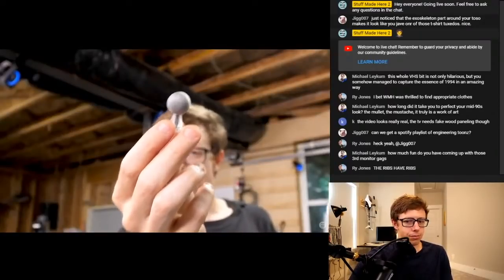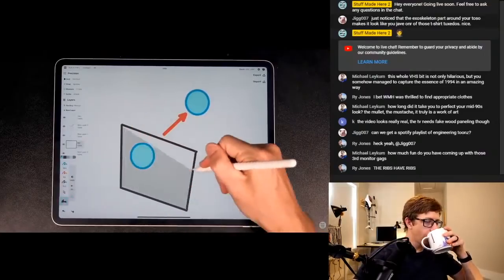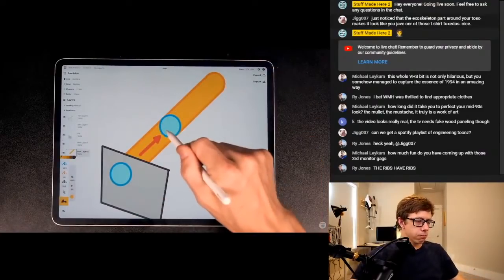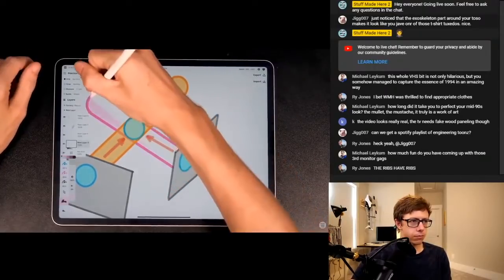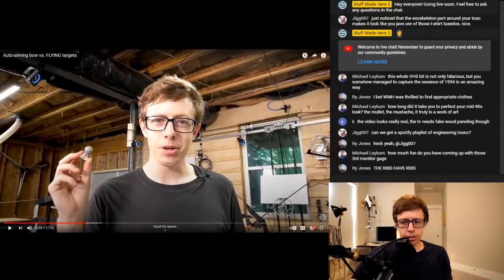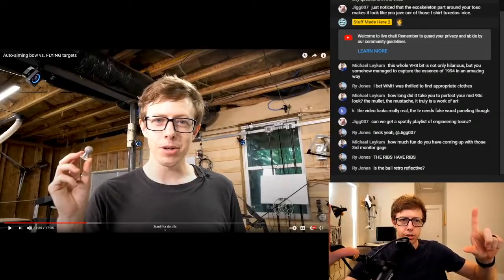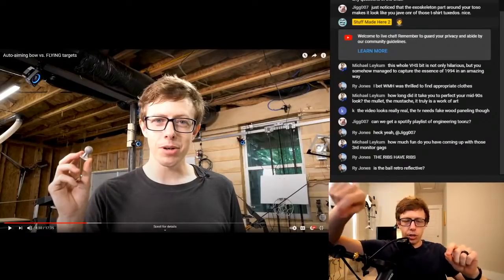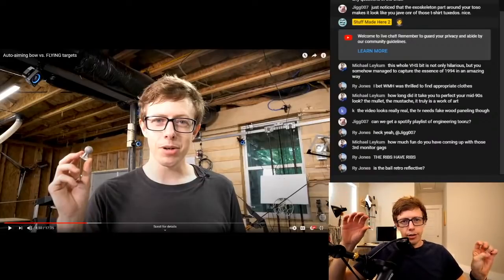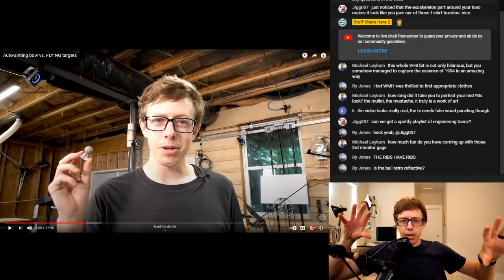Here's how it works. If I hold up this little reflective ball, it's seen by all the cameras at the same time. The camera takes a picture and if you project an imaginary tube out from the ball in the image, we know the ball must be in that tube — we just don't know how far away it is. If we add another camera looking at the ball from a different angle, we get another tube, and the intersection of these tubes gives us the location of the ball. The detail I'm glossing over is that you need to know where the cameras are. That's what the wanding is — you have a stick with balls at known locations relative to each other. When you wave that all around, you get a ton of pictures from all the different cameras, and then they look at the correlation between the different views of the thing of known geometry. It does basically an optimization where it figures out the locations in space for the cameras that would make what they're seeing make sense.